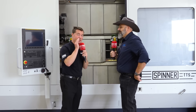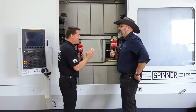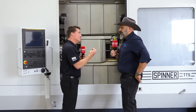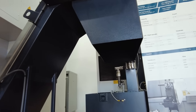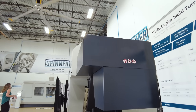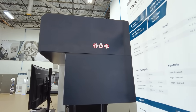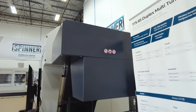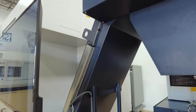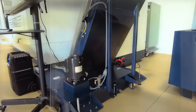Something I've heard that I think is overlooked — the chip conveyor. The chip conveyor is wide; it's going to be able to remove everything. And if you look on the far side, it actually has an increased height to make sure you're getting all those chips out. I've walked into shops where people are more frustrated about chip bins than the machine itself. But that chip conveyor should come out of a horizontal machining center — it's huge. We could have chip-conveyed you right out of there!